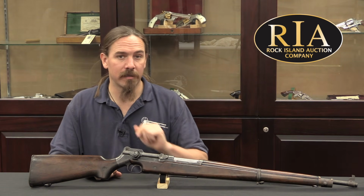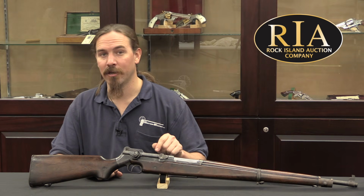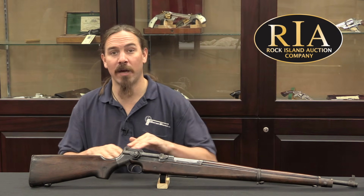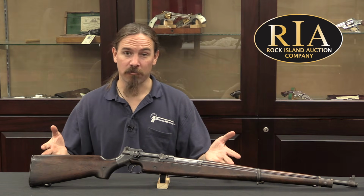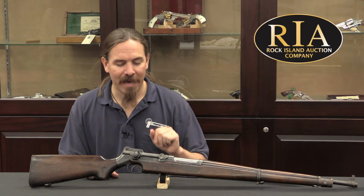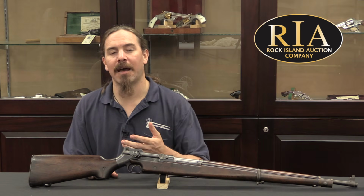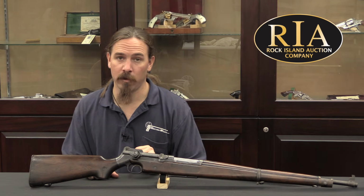And you know the military is not going to be willing to adopt 2 different versions of the same cartridge, where if you accidentally switch them up, the machine gun ammunition just flat out will not work in the rifle. There's no way that's going to get adopted. So when those 2 changes happened, this rifle was gone, dead, had absolutely no chance left. And that left Garand in a position of having to redesign the rifle. And as a result, we would end up with the M1 Garand that we have today, with a long stroke gas piston under the barrel and a 2-lug rotating bolt.